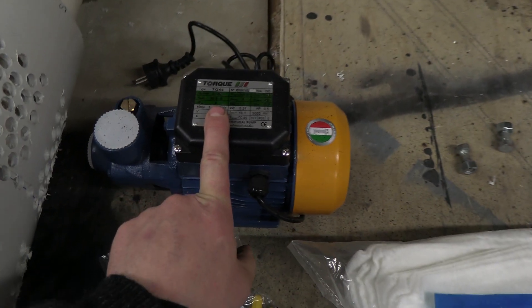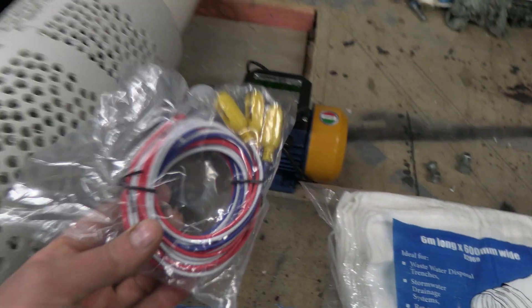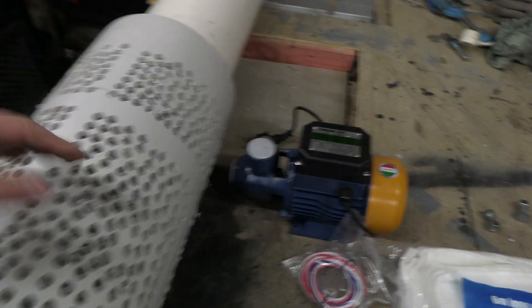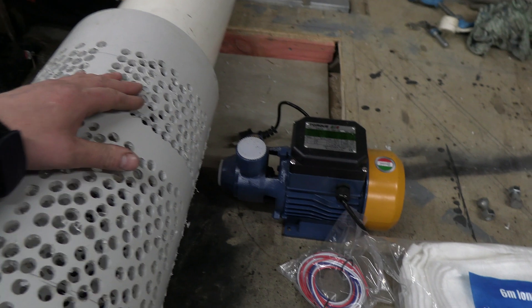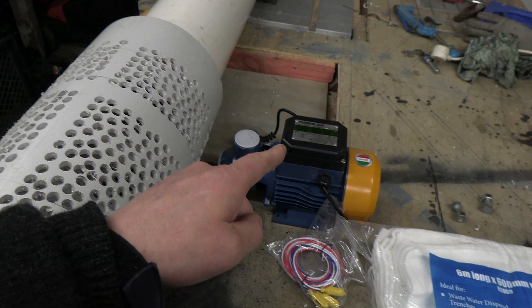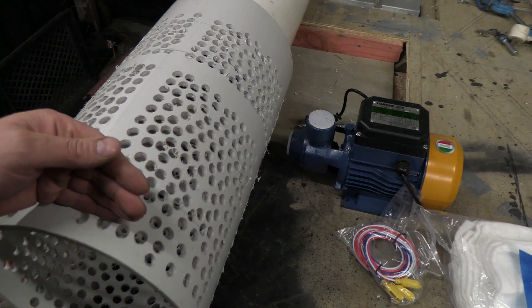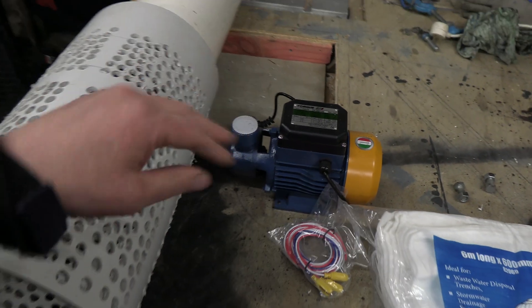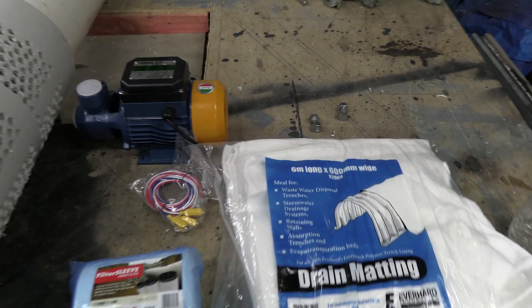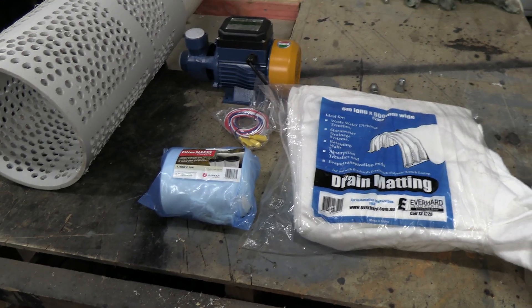This is the pump that's going to do the sucking — it'll have some pipes on it. The way it'll work is it'll use some sensor probes: one at the bottom, one at the top. Because it's a shallow well, it'll take a while for the water to fill it. When it slowly fills and reaches the top probe, the pump will turn on, suck all the water out, then switch off once it hits the bottom probe. It can then fill back up and keep repeating that cycle until it fills up my rainwater tank. This water I'm going to use for irrigation.